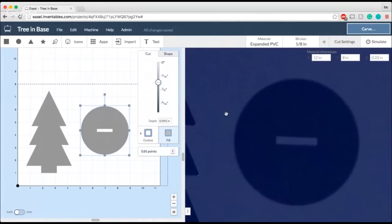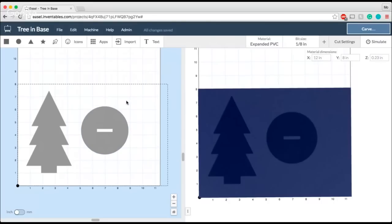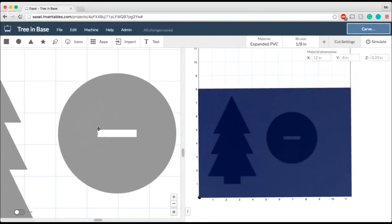Instead, what I have to do is use a technique called dog bone. What the dog bone allows is for these corners that are really sharp to be rounded, so that when the round bit cuts them out, the shape will actually be this exact dimension, just with these little rounded corners so that the piece will fit in there snugly.